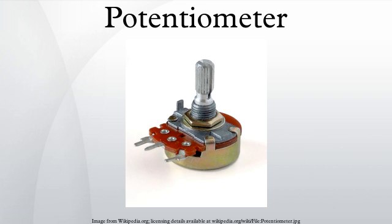The top layer is thin glass positioned close to a neighboring inner layer. The underside of the top layer has a transparent conductive coating, and the surface of the layer beneath has a transparent resistive coating. A finger or stylus deforms the glass to contact the underlying layer. Edges of the resistive layer have conductive contacts. Locating the contact point is done by applying a voltage to opposite edges, leaving the other two edges temporarily unconnected; the voltage of the top layer provides one coordinate. Disconnecting those edges and applying voltage to the other two provides the other coordinate. Alternating rapidly between pairs of edges provides frequent position updates, and an analog-to-digital converter provides output data.